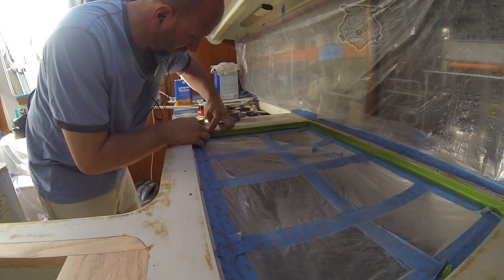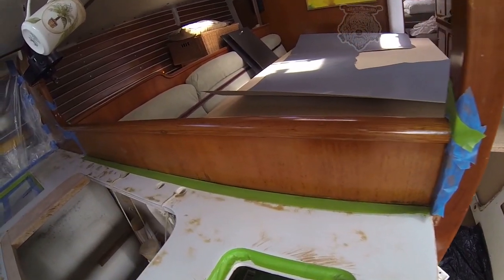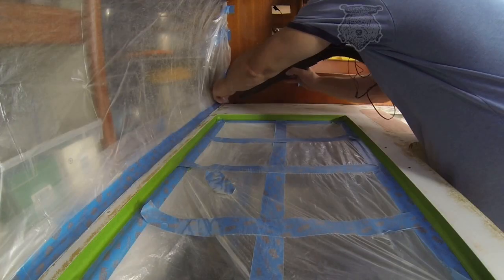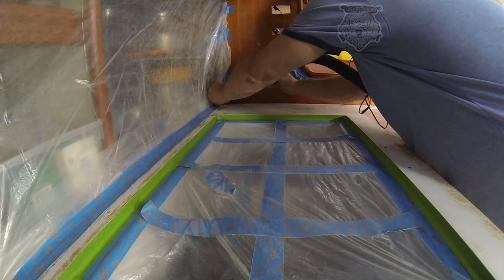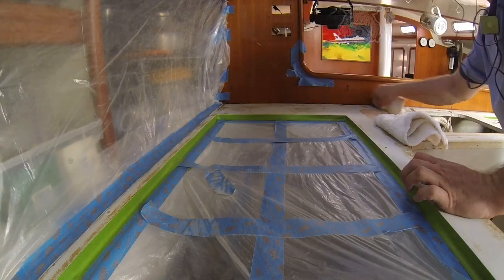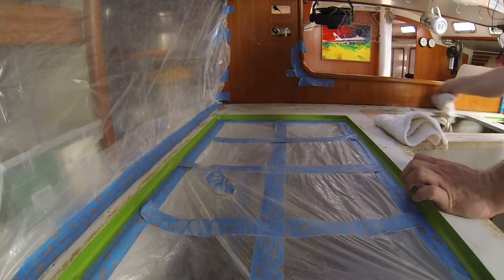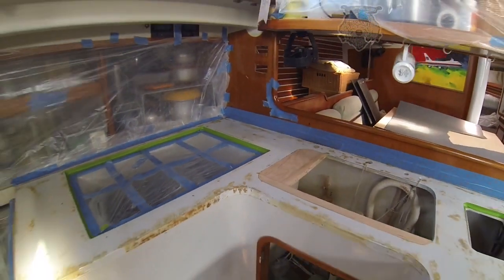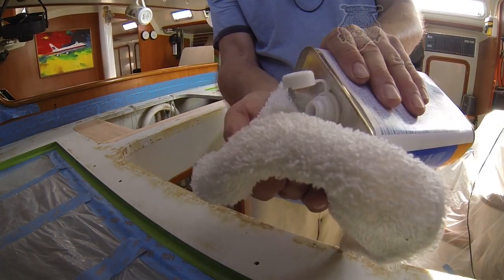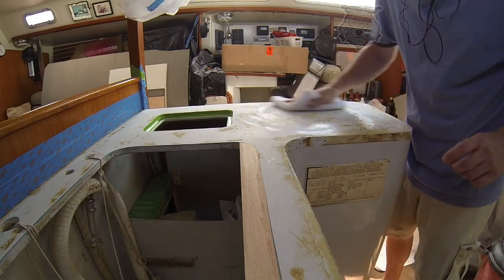And it'll open up in another window. Now I want to tape off all the edges that I don't want glue to get on — all these inside edges. So I'm just prepping here for the contact cement. The green tape is on the inside, and I don't want glue to get down in there or up against the wall, so I'm just prepping all my edges for the contact cement. Then I'm going to clean everything up really good again using acetone.